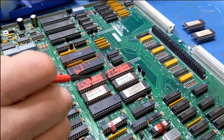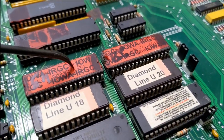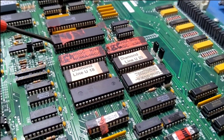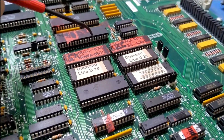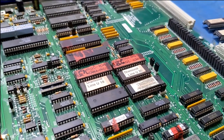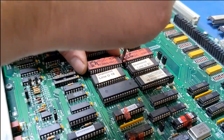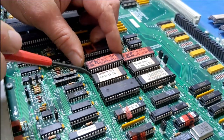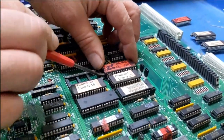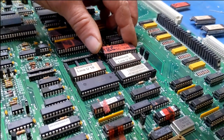Also on these chips, make sure that you can clearly see the markings. Like this one is U-43. Make sure you can see the chips say U-43 and U-28. If it doesn't have markings on it, mark them now so you don't have any problems down the road. This has both — it has a Sharpie marking on it as well. Mark them so when it's time to put them back in there's no confusion. So just lift them out. And don't get underneath the socket — make sure you go between the socket and the chip when you're lifting.